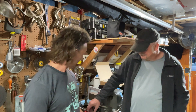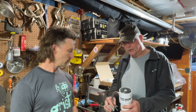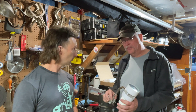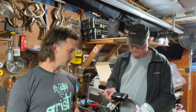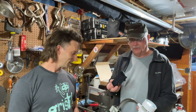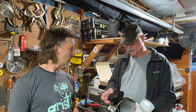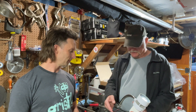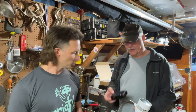So Dirk, tell me what we got here. This is the WSAD weather station. It transmits on the ISM band on 915 megahertz. It doesn't use LoRa, and this is the bridge unit that we're building, which receives that signal — it's a frequency shift key protocol — and it retransmits it on the Helium network. It's powered by a battery inside and a solar panel on top.